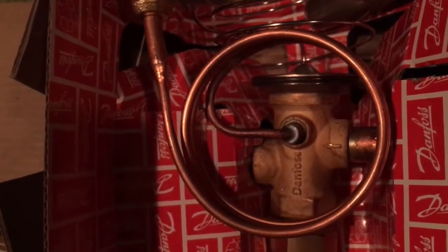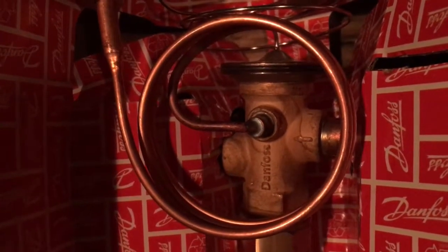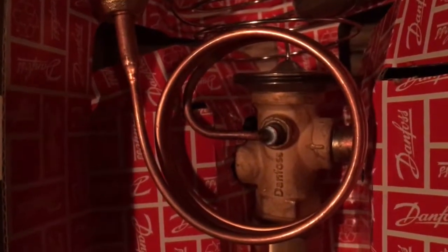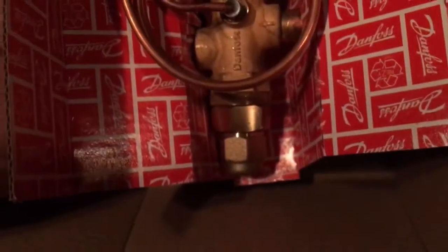The liquid, as you know, would flow through the expansion valve and come out the other side. For cooling, your liquid line would go in the right side. Since it's a heat pump, refrigerant will flow both directions — it'll open up in heating mode, so refrigerant will travel the other way. The stainless steel powerhead looks like they're all welded by a fancy machine.